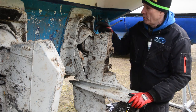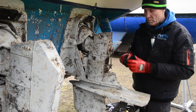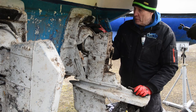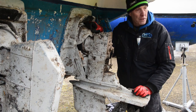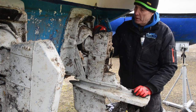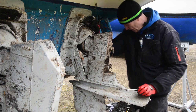And the way we do that is these two Allen key bolts here and the steering helmet pivot pin which is in there. They're held in with 5/16 Allen keys. And the reason I mention that is, be careful, because most people tend to have metric Allen keys and you'll round them off if you try. Especially if there's some muck and dirt in there, you'll think it's in, you'll do it, you'll round it off. And the problem with all of these bolts is, if you do damage the drive head on them, getting access to them to get them out is a pig of a job.